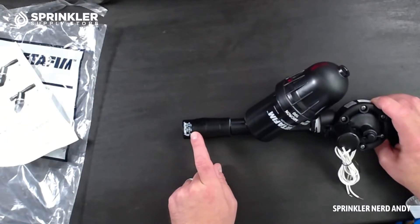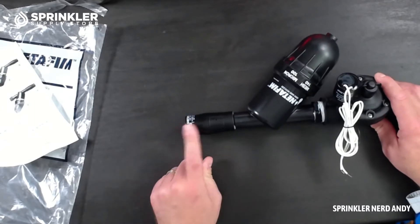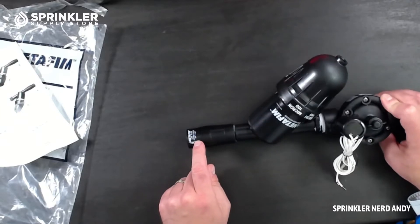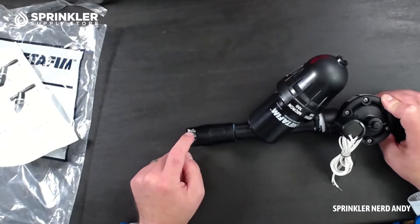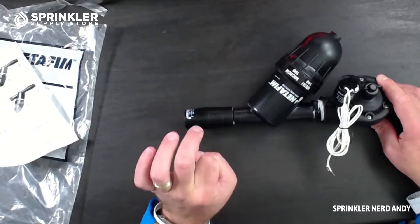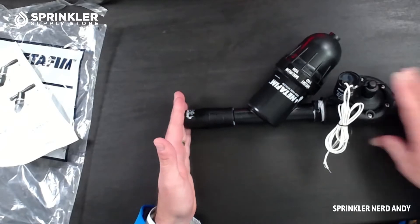It's a three-quarter inch pressure regulator at 43 PSI, and this is the one I'd recommend. There's really never a reason to use a lower one like a 35 or 25 PSI regulator. Always go with as close to 50 PSI as you can, because 50 PSI is the strength that holds those barbed fittings together, so you'll be able to run a little bit further distance with this.